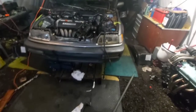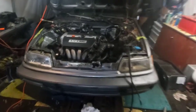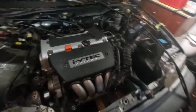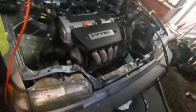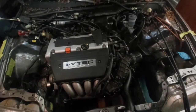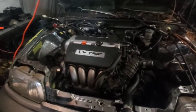Of course you have to lift the car up and get the engine underneath — the subframe has to be out, along with the little front subframe piece. That's where I'm at; I'm pretty sure it's about where it needs to be. From all the photos I've gathered, it looks like the hood might actually close — it might be half an inch lower than Hasport's mounts, which should be okay. Looks sick though.